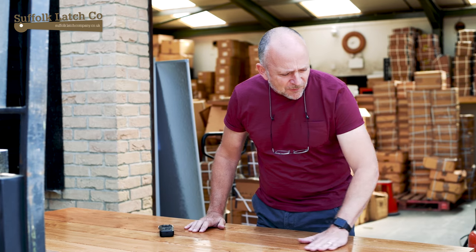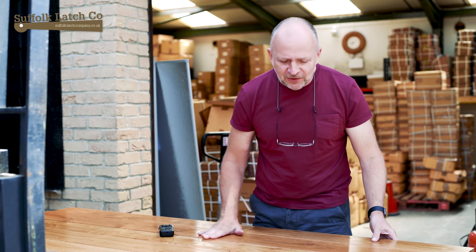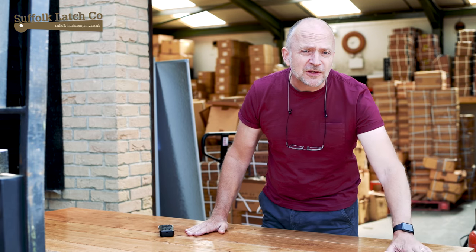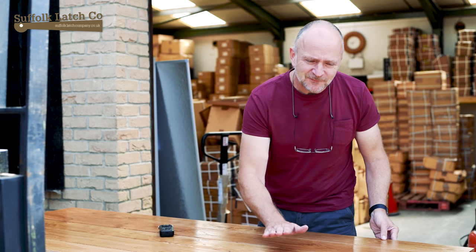Well, that's now been knocked back with the 600 grit emery cloth. It's very, very slightly less shiny but it is completely silky smooth. So we're now good — I'm happy it's protected. We can now install this door without fear of actually getting it marked up on the wood. Thank you.